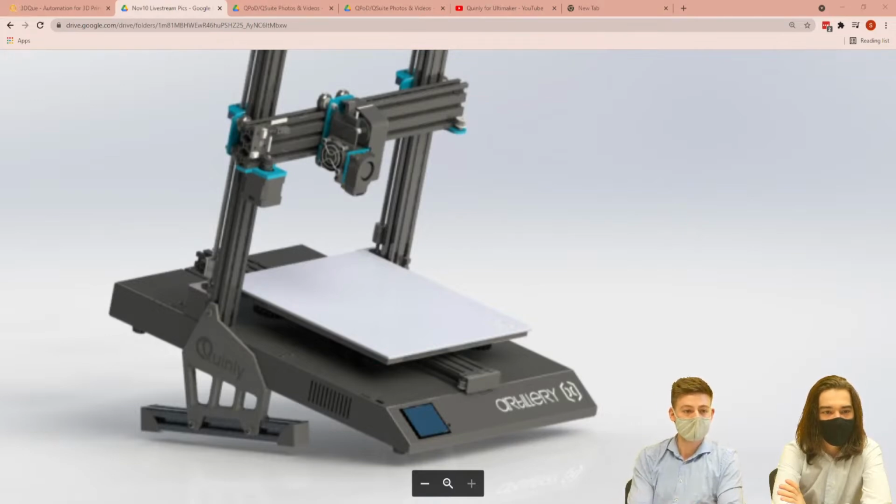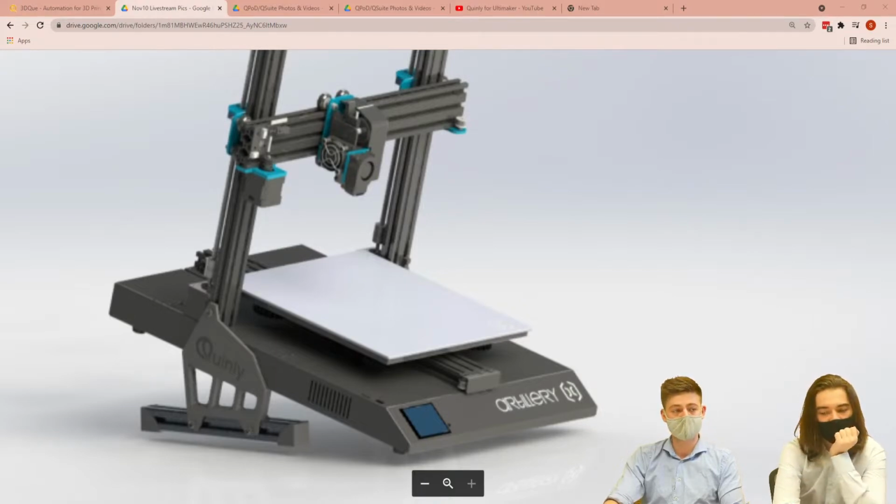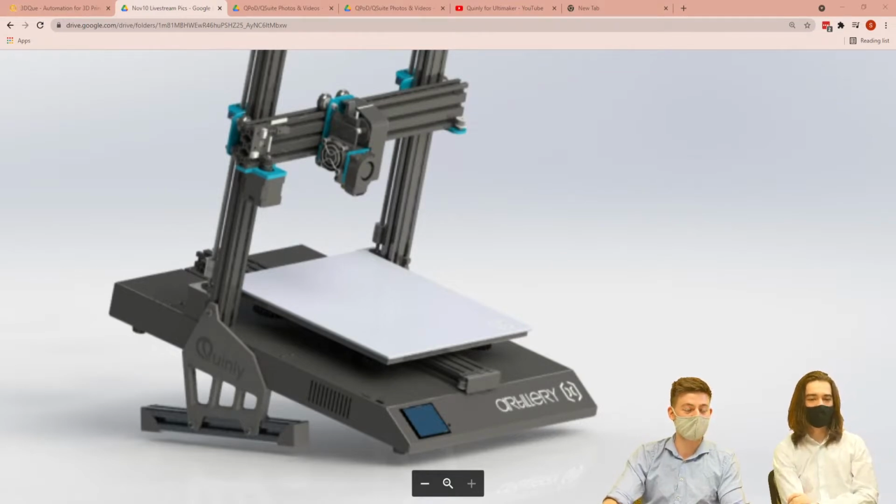Bob's asking, is direct drive better than Bowden, in terms of wear and functionality? The Ender 3s all run Bowdens that we use and they work fine. We've replaced all the hot ends, but they're still Bowden E3D V6 hot ends. It works very reliably. I don't think we've had any Bowden-specific failures. It's mostly the extruder or the hot end. The tubes have been great. Honestly, the tubes don't wear out. We just have the basic stock tubes on a lot of the printers.